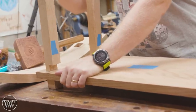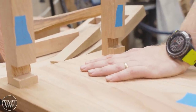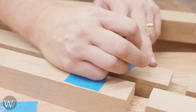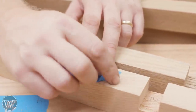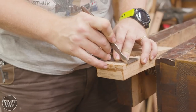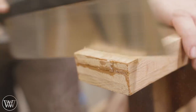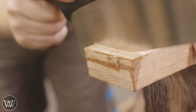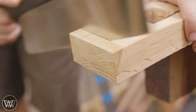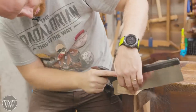Everything comes out. These may look like they're wiggling a lot but they actually have that wedge slot, so there is space from the wedge for them to wiggle around in and they slide out. The other thing I want to do is put final marks on this. We're going to take all the tape off and right after we do that, we're going to mark inside all the joints where nothing is ever going to be seen. Then we're going to do all of the trimming — cut these down and clean them up, and then we can go through and start chamfering everything.